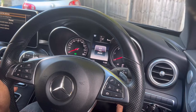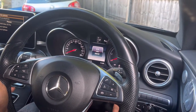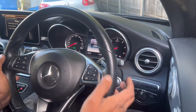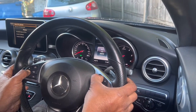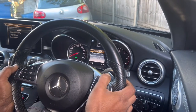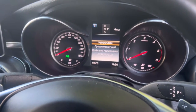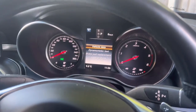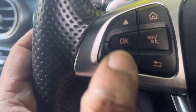Sorry, it didn't work. I'm switching off the car — ignition off — and pressing it once so it's on again. Then press call and OK button at the same time. Right — you can see now when you press call and OK together, it comes to this menu. Once it comes to this menu, you need to scroll down with the arrow key.